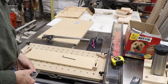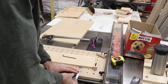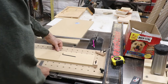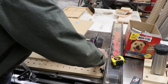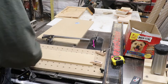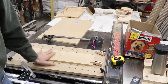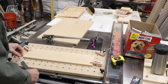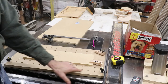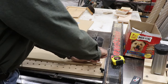The clamps have a step in the back so that when you clamp them down, you can get a lot of tension on the workpiece. You can clamp anywhere from one-quarter to three-quarter inch pieces with that step. The first thing to do is set a distance from the edge — that can be arbitrary in this case. I check my distance on either end to make sure I've got the same distance on both ends of the test piece, then finish tightening down.